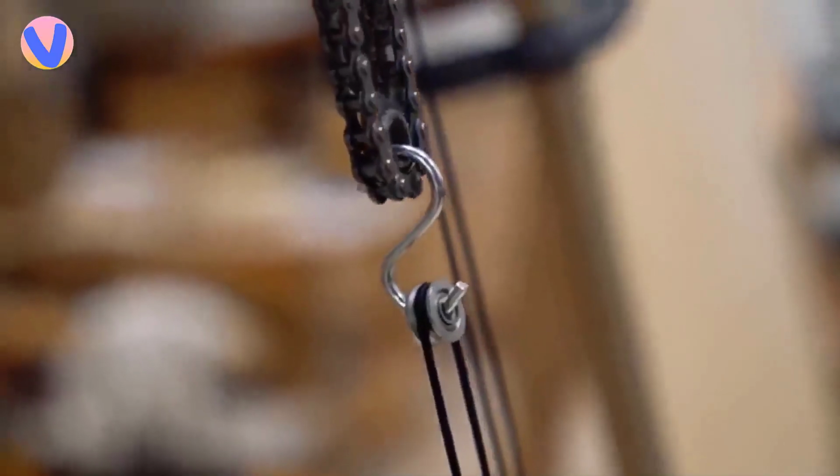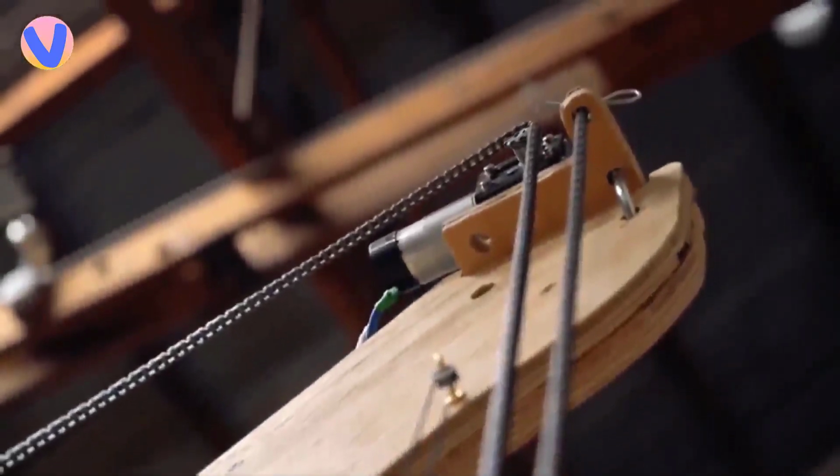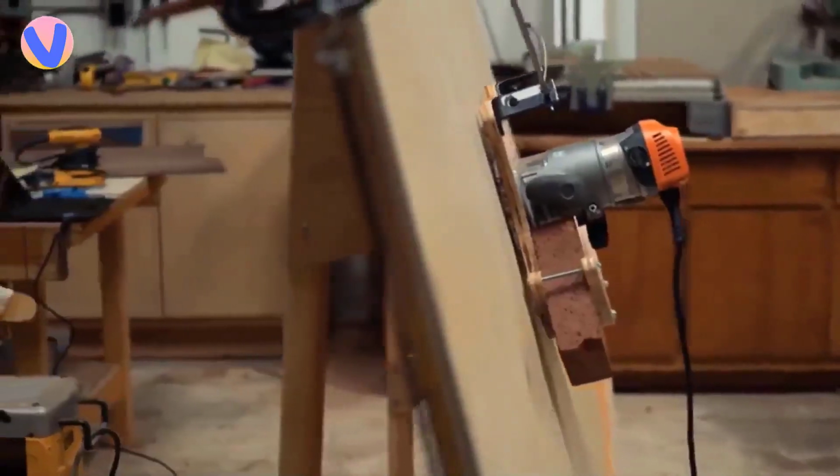Our solution, Maslow. Maslow uses gear-reduced DC motors with encoders and a closed-loop feedback system to achieve high accuracy and high torque. More details for nerds can be found below. Maslow stands only 19 inches out from your garage or shop wall, leaving plenty of space to park a car.